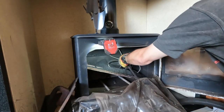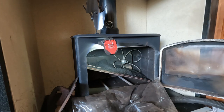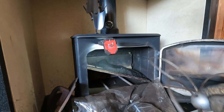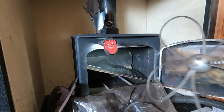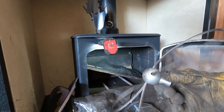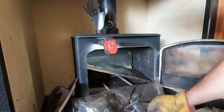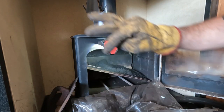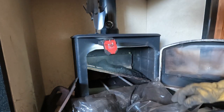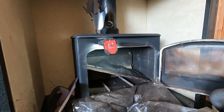There we are. Got to be careful of your cable loop, because if you've got a pot, you can only use these on masonry chimneys, so generally clay liners or concrete liners. You do not want to use this on flexible liners at all, if you can help it, but I mean, one day you might have to. I would say you can probably use it on twin wall, if you're careful. But because they've got loops, if you've got a crown pot and you push it out of the top of the pot, as you bring it down, that loop can hook over the points on the crown, and you never get it back. Be careful. I've not done it, honest.